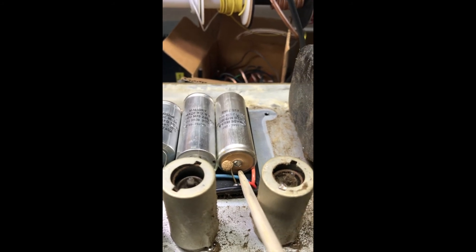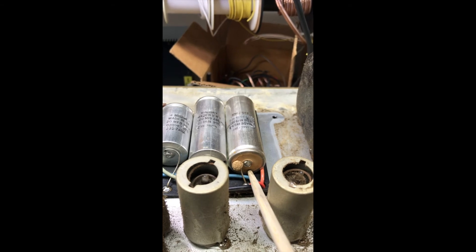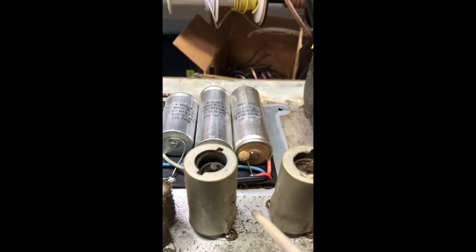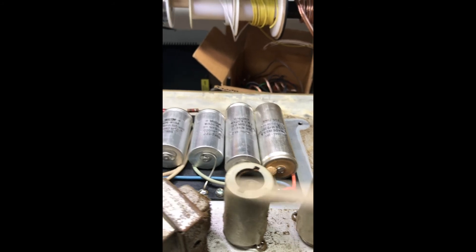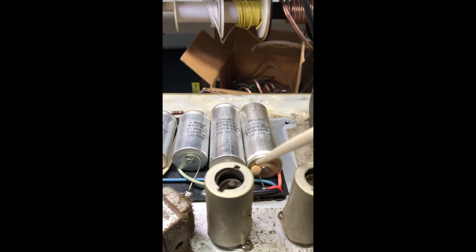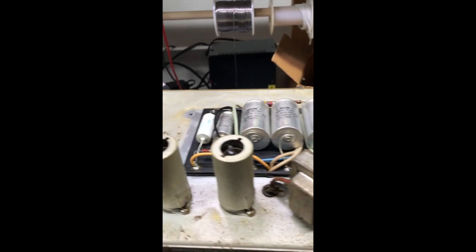These are good for about 12 years. So from 72 — 82, 92, 2002, 2012 — they're all worn out. Of course they're all worn out, so these need to be replaced. This is very likely the reason the fuse blew and completely shot the power tubes, plates, etc. So that's this amp in a nutshell.